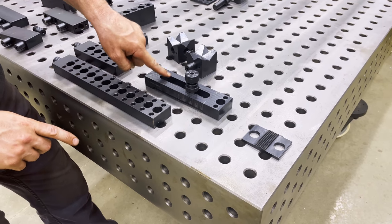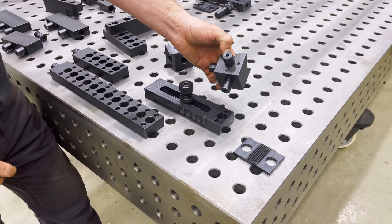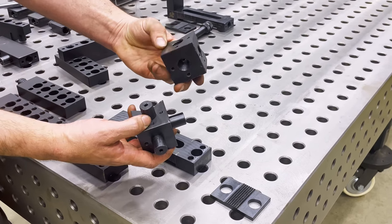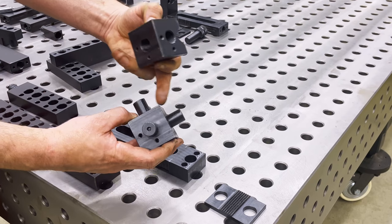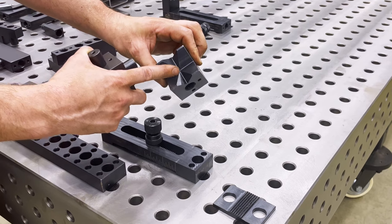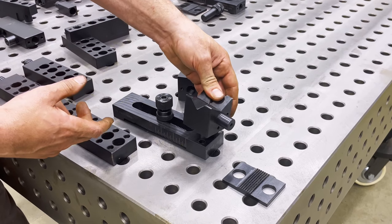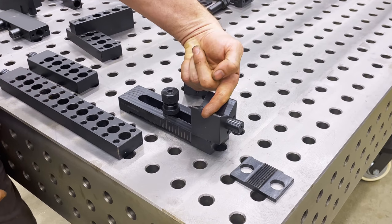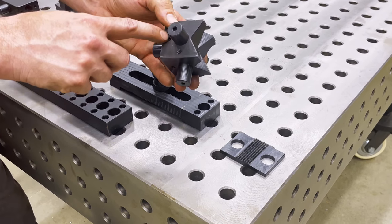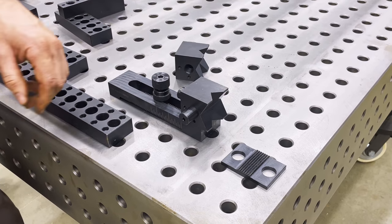The block has a hole in the end to allow you to put fixtures at the end of the stop. So this is basically a 90-degree block with a V-block inside of it. This is the configuration in its natural form and I've put three pins in here. You can remove or take them out as necessary, allowing you to use the 90-degree V, the 120-degree V, and set it up in the situation that fits your needs. So you can drop it in like this, put something on top, go the other direction, put it vertical or access the other V. And this has tapped holes in the side so you can bolt it to the block and fix it permanently in that location.